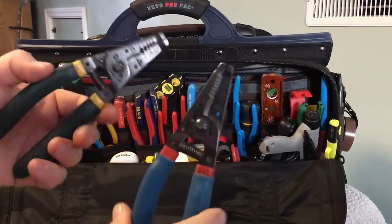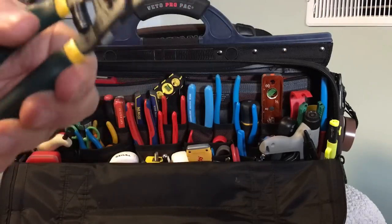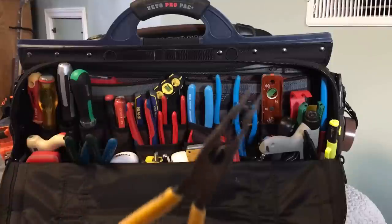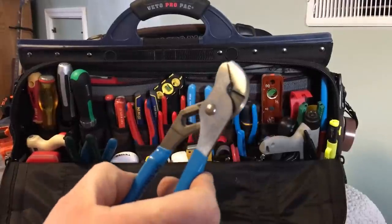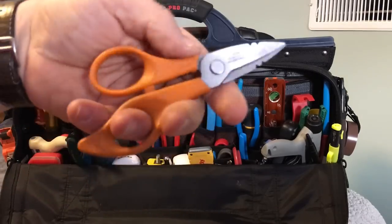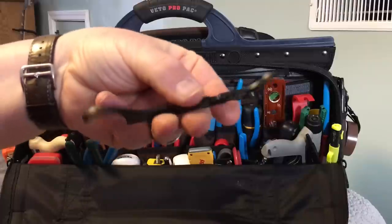A couple of wire strippers — these are from 22 to 32 gauge for small security wires and whatnot, and a standard 12 to 16 gauge. A bunch of miscellaneous stuff: specialty needle-nose with the crimp zone for the 3M bubble splices, a small pair of Channel-locks, a set of hemostats for fishing wires out of little tight deep spaces, a set of telecom/speaker scissors — Fiskars I believe — and a wrench for half-inch electrical lock nuts for electrical fittings. I lost the three-quarter so I'm going to go buy another set.